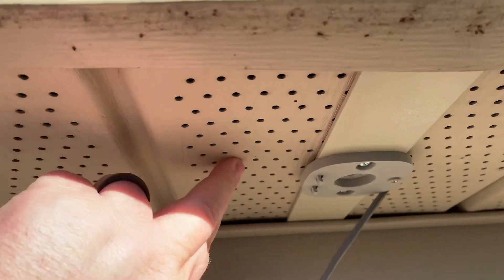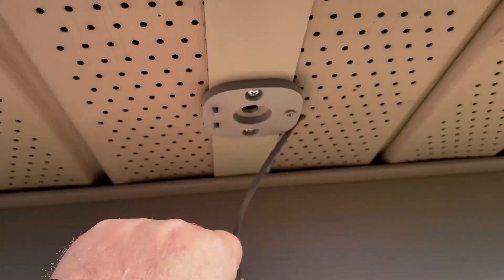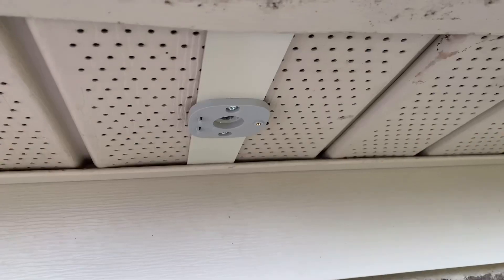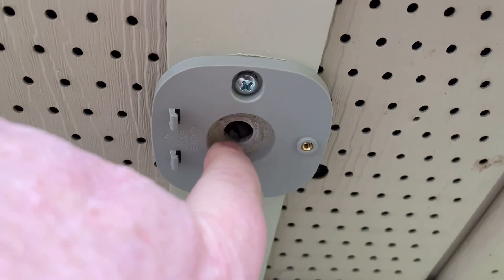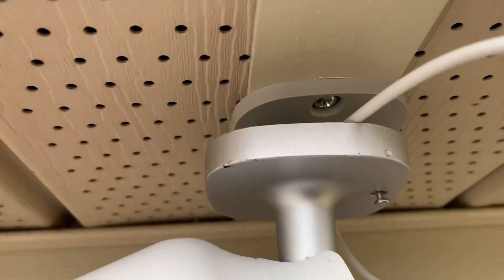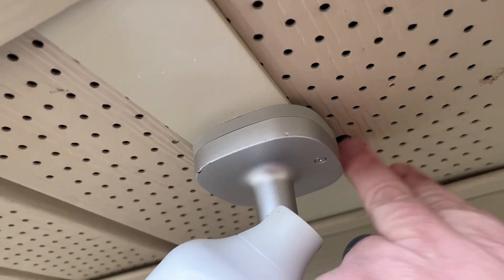You can see if I were to mount it on the soffit alone, it has a lot of play in it - but this bracket is not going anywhere, it's solid. To make it even more solid, you can take one of these screws, tap it right there and right there, and it's not going anywhere. I got the bracket, my hole drilled in it. I do have to put a little bit of silicone in this hole - I may come back and do that just to be sure. I gotta get this wire pushed all the way up in there, then this will snap on and the little screw will secure it. It looks pretty neat - all the wires are hidden.